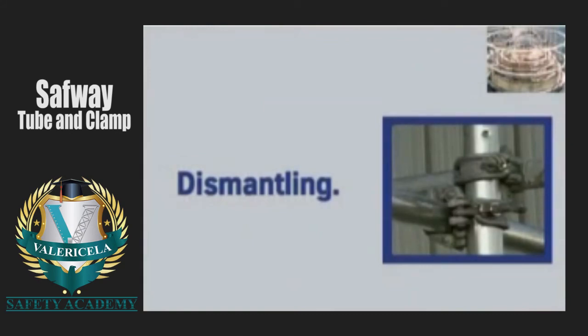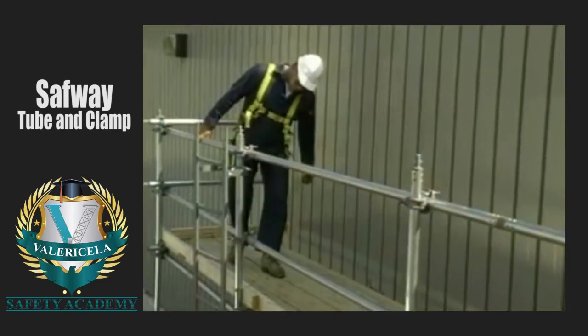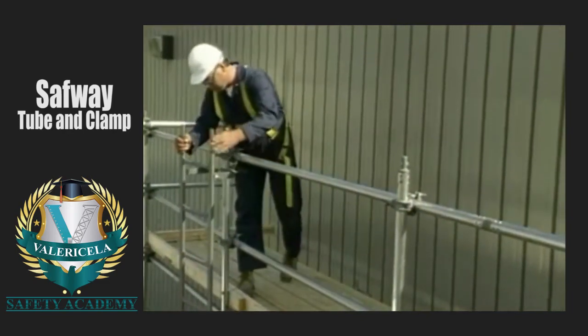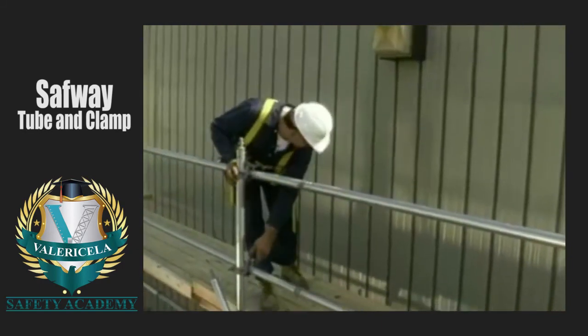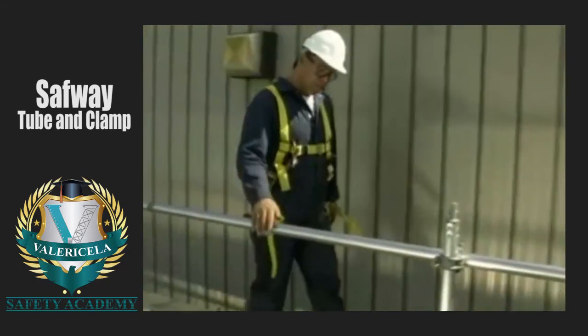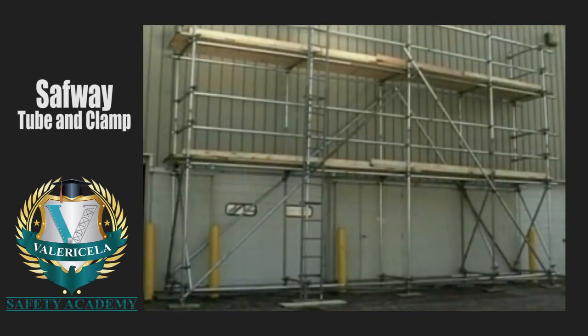Dismantling of a Safway tube and clamp scaffold is quick and easy. Inspect the scaffold to ensure that it's safe to dismantle. You may have to add parts or increase the base width of the scaffold to correct any unsafe condition before tearing it down. Then simply reverse the procedure.